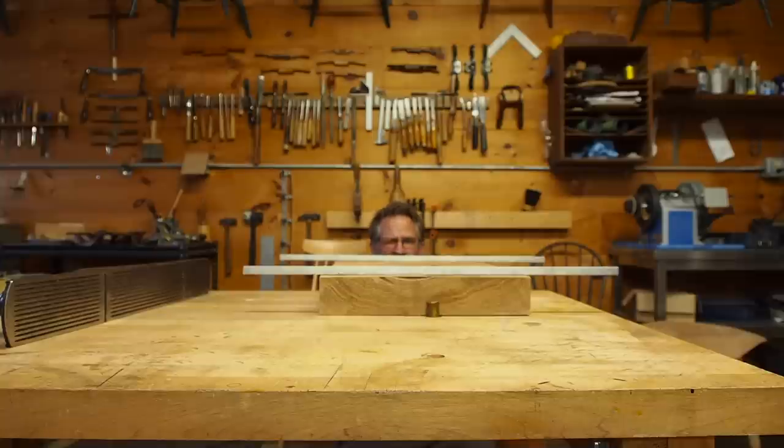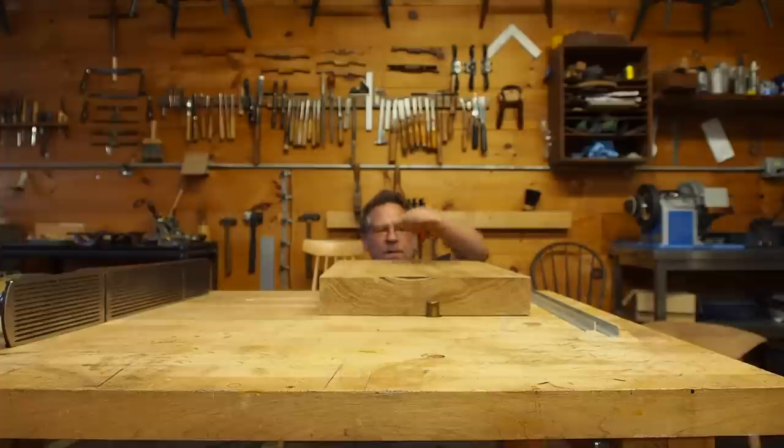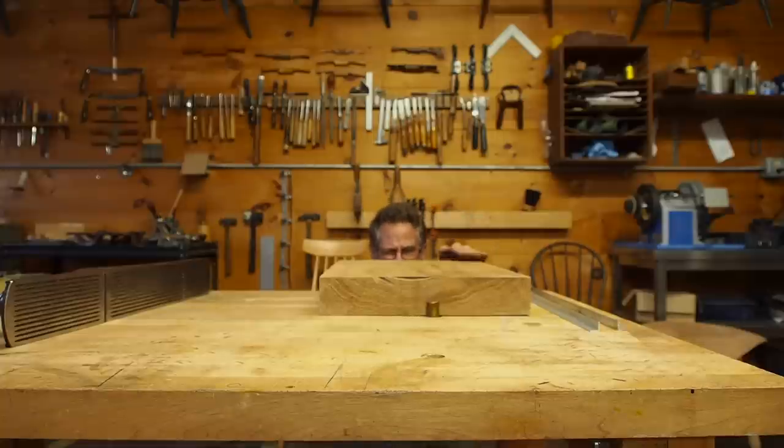So what I see when I look across my winding sticks is that there is a little bit of a twist to it, but that's not really the issue that most concerns me. It's that there's a cup here. I don't really even worry on a short piece like this that much about any bowing, which would be this direction. What I'm looking for is that cup, and the cup is up right now,